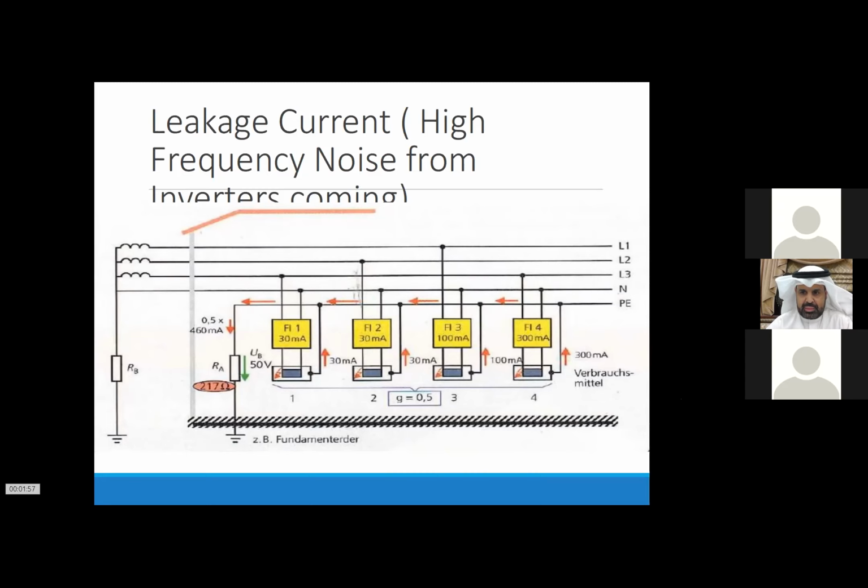Thank you, because I've faced such a situation before, and someone was telling me we can have cases of leakages on the AC side that can affect the DC side if you combine the earthing. Yeah, but it depends also. I was also in Vietnam. They said to me AC and DC must be separated, and then they put two earth spikes 1 meter next to each other. So there's no way the earth from AC says, I'm going to stay at my side, and the DC says, I'm going to stay on my side. If it's 1 meter next to each other, they will combine at the soil if it's wet.